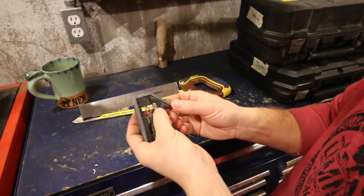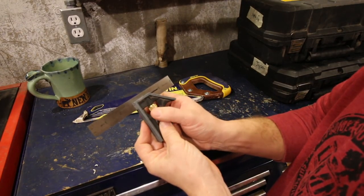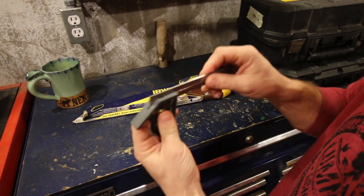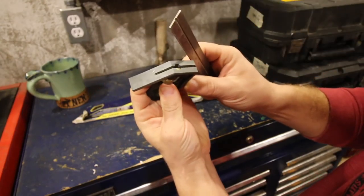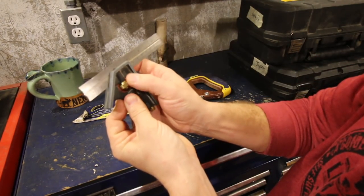The Swanson one has a nice brass lock nut with knurled grips on it, which is nice. You tighten it up and it locks it in place. You loosen it and you can slide it. You can take it all the way out — it's spring-loaded in there. Make sure your groove's lined up, push it up, slide it in, then tighten the nut back up.